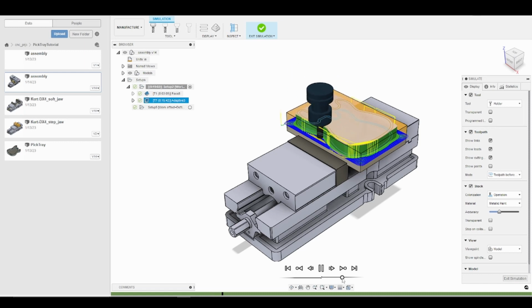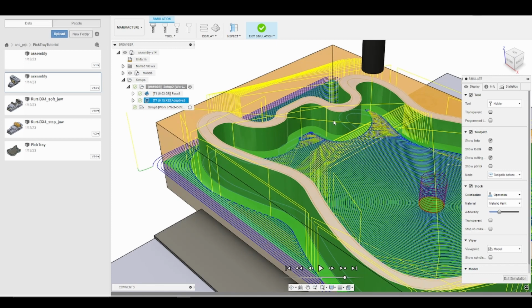I'll show you guys the helical entry, and then there are a couple points I would like to emphasize at the end of the toolpath. So there was the helical entry, and now we're just hogging out material in a circular motion in the center of our tray. And what I really want to emphasize here, okay, let's finish, is if we zoom in, you'll notice our end mill was too big to really get into those tight corners in the upper and lower horn, as well as out here, where if this was a real guitar, the neck pocket would be.